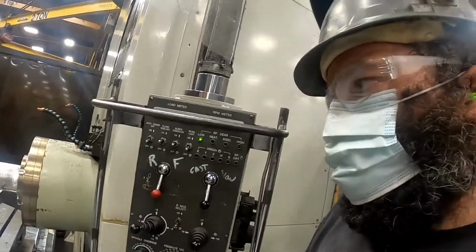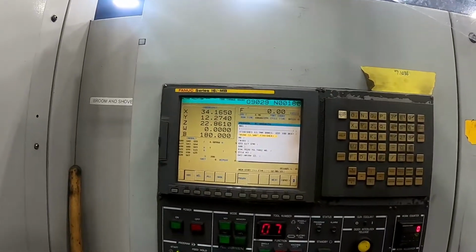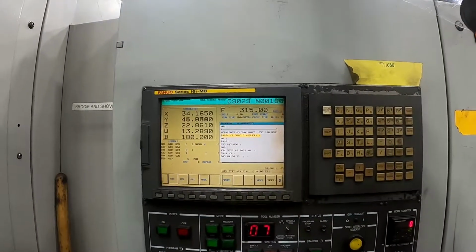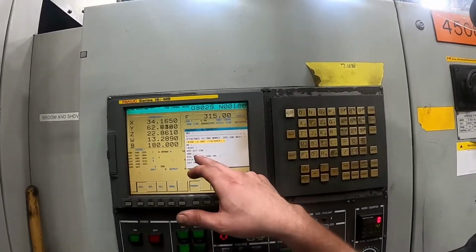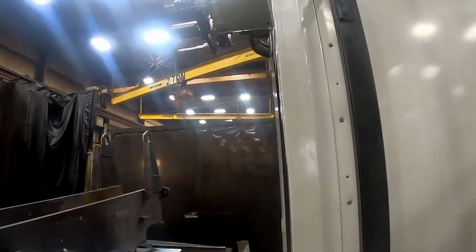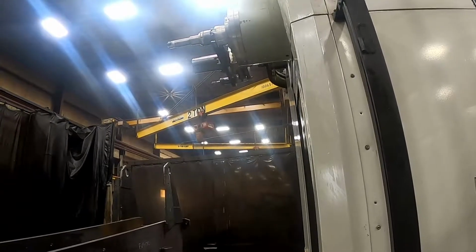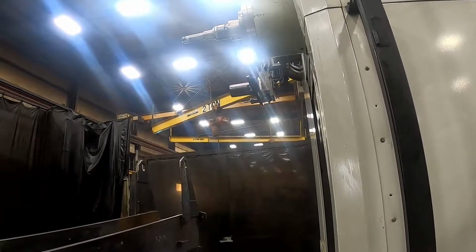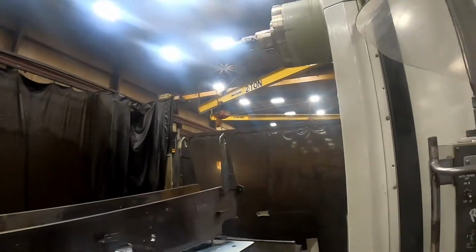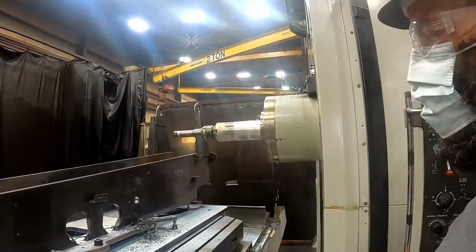Next tool change is the last tool it runs on these parts. Once again, a little bit of the programming. It's telling which tool to pick up, and then it gives its offsets again. Tells the location and what to turn the spindle on to. This tool is finishing the bores. It's a smooth finish, and that's what the pin will go through.